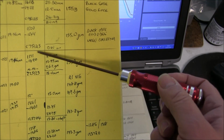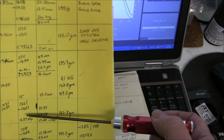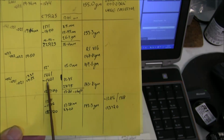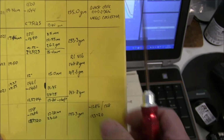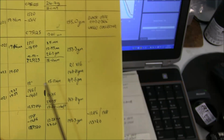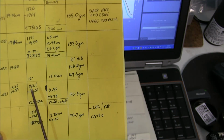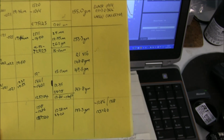The Gauss strength does vary a lot. I said these rotors, I think, will come from the same place. They probably don't select them out. This one on the R1 was particularly well matched, the north and south poles, 1461. Anything above 1450 up to just over 1500 seems to be the optimum range these days for a 2S touring car especially, and also high Gauss 1500 odd is very good for 1S.